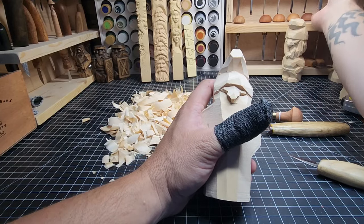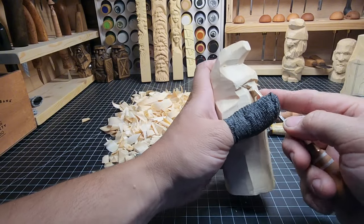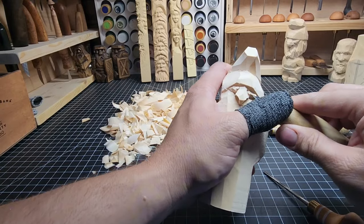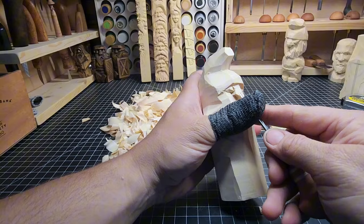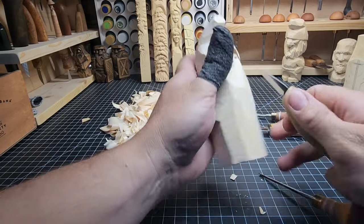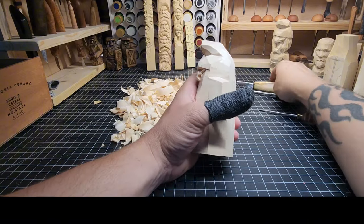We can only take away, but we take away a little bit like that and we gave him a funky nose. Now I'm going to use a different V-tool — a smaller one, still number eight but a two or three millimeter number eight — to put some little channels right here on the side of the nose. Cut those out, and I'm going to smooth out that cheek. The cheek is lower on the left and right side of the nose and curves up to it — that little channel I'm making is that curve.